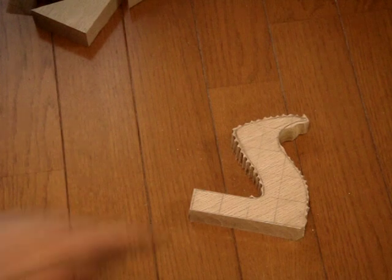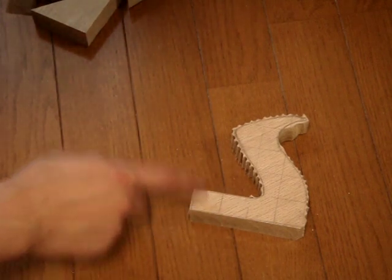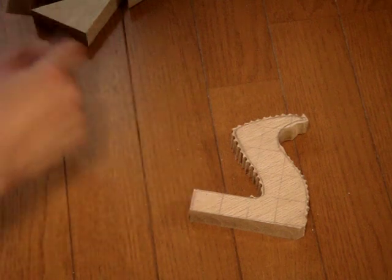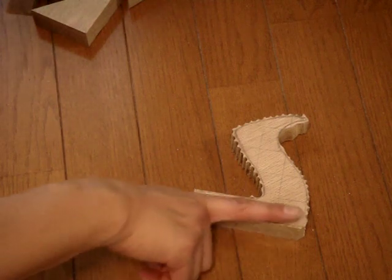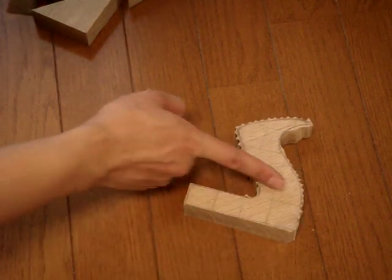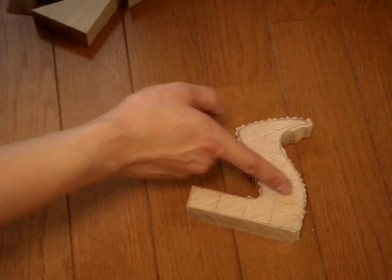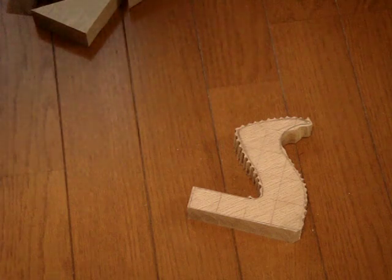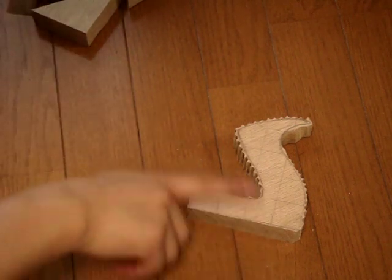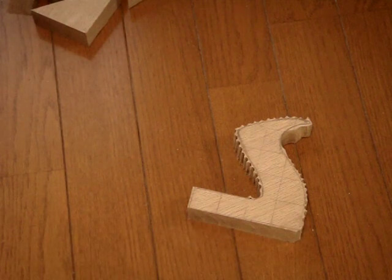And once this is done, don't chop out the mortise in your body yet, because once this is done you'll use this to mark it. So first get everything here cleaned up. Keep this bottom section obviously flat and square, and you also want to keep the contours, when you're carving, maybe slightly above here, so that you can finish carving them off when they're on the plane, and that would prevent you from carving into the tenon here and creating a gap.